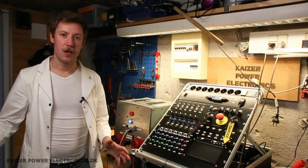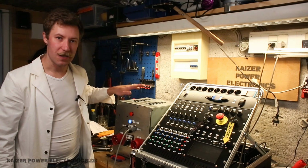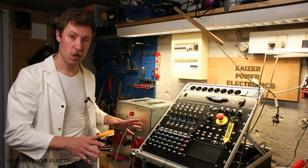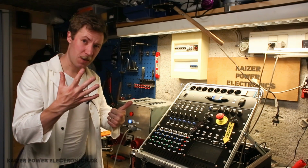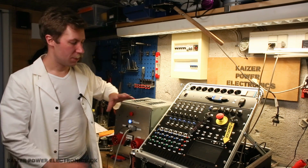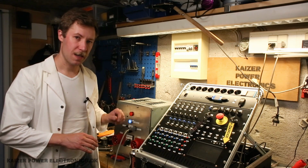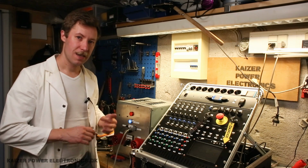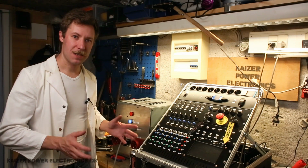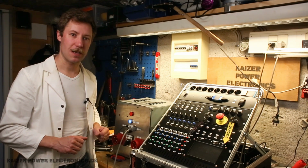This really does conclude the whole 2-year project of building the 6-coil show controller. And now with the soft start safety box, this really sets this off as a complete show setup for 6 Tesla coils all at once, playing MIDI, playing normal interrupter, full safety features, really a, I won't say bulletproof setup, but at least a very safe setup where I use industrial grade components and safety rated components in order to keep this mains part as good as possible, and in case of any component failure we should see complete power off on the dangerous parts.